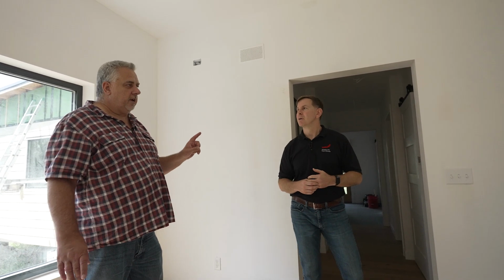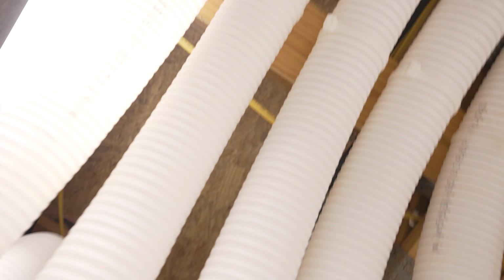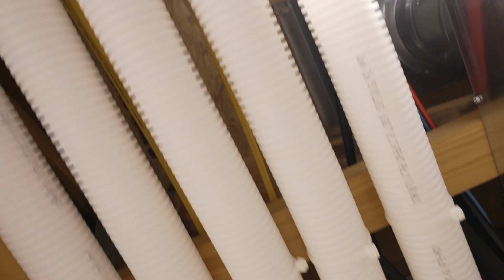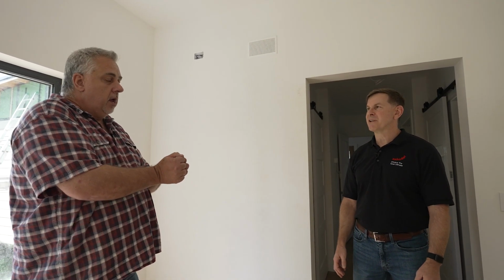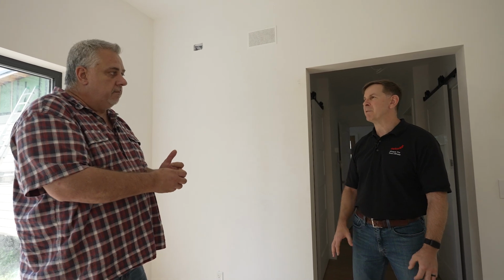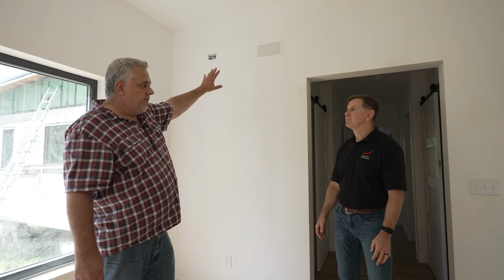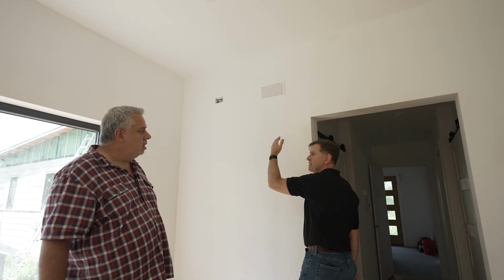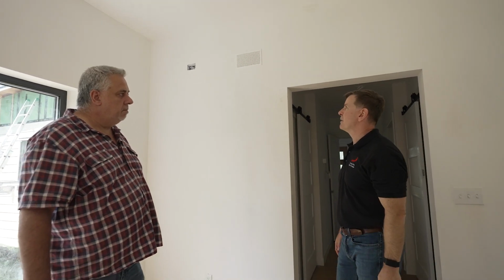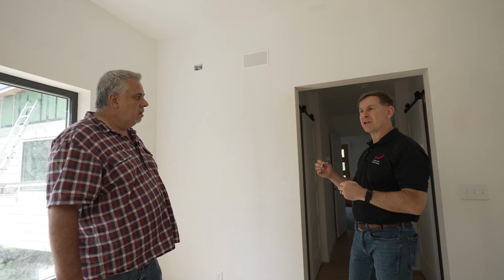Let's give a little bit more credit, because I know there's more to that tube than you're leading on. It's a 3-inch tube, right? Yeah. So it can fit in any 2x4 wall. Exactly. Can get snaked through. Yeah. The radius is extremely tight. Like you can bend it on itself. Yeah. Yep, stays pretty smooth as you do that. So, minimal restriction of airflow for the bends that you get. And these aren't running at very high volume either, right? It's not. You have to get your hand right up against it to actually feel it. Right. The amount of air that's coming out there is nothing like a heating and cooling system. Right. We're not carrying BTUs, we're just carrying fresh air.